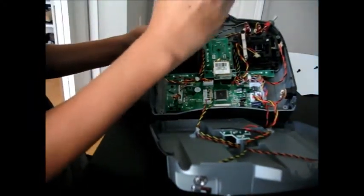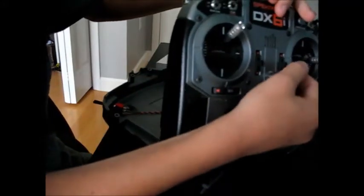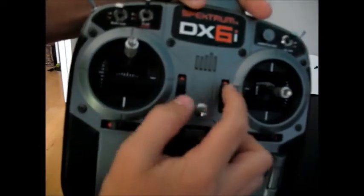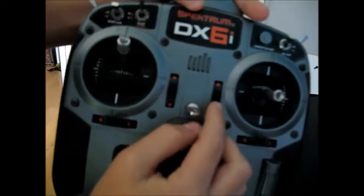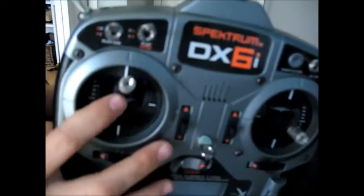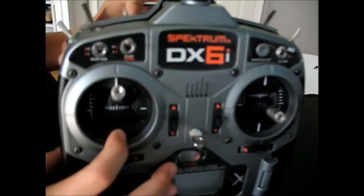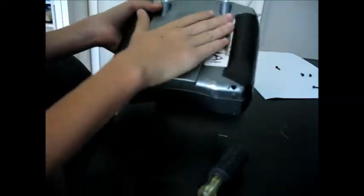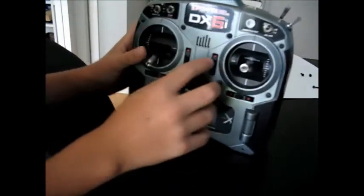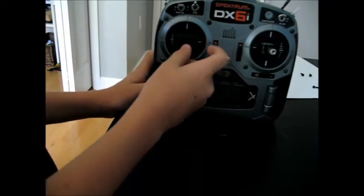Before you seal up your transmitter again, just flip it over to the front side and check and make sure that both trims work. You can even hear now my up trim that used to be broken — that's the sound of that. Now listen to the other trim — this one sounds even stronger. So if you want to, you can even reinforce all of them while you have it open. Now all you have to do is screw in all the screws back here and you are ready to go — everything is fixed. Thanks everybody for watching this DX6i trim tab repair video. Don't forget to like, comment, and subscribe to Clinger RC, and we'll see you next time.